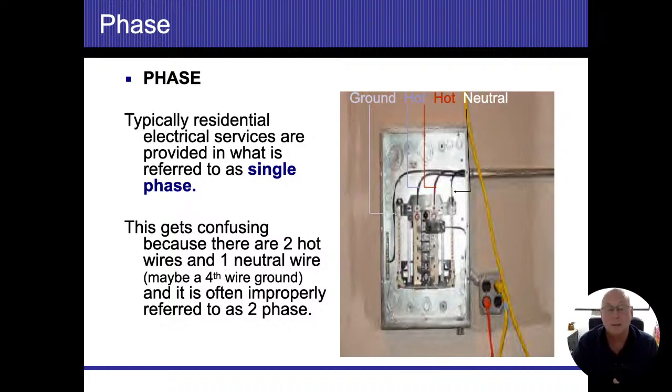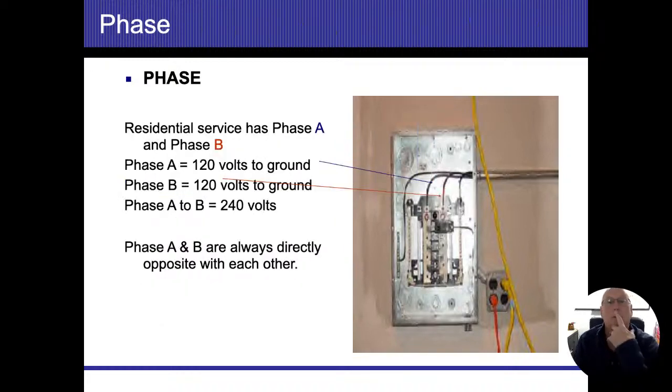I'm going to ask that you refer them off to an electrician and just say you don't know. So don't take the cover panels off unless you know what you're doing on those. Again, you're going to have three energized conductors. The easiest, quickest clue that you're going to see is three breakers all tied together. Typically, they're going to be on either commercial buildings or very large residential buildings.